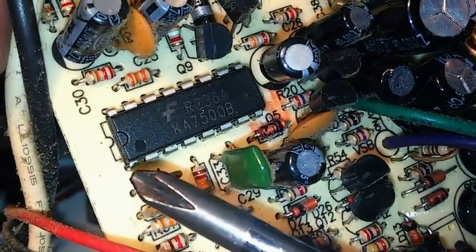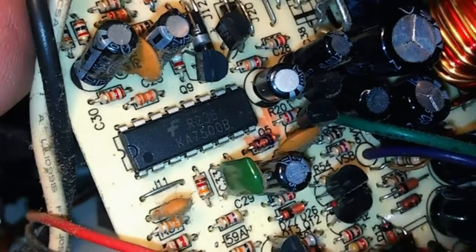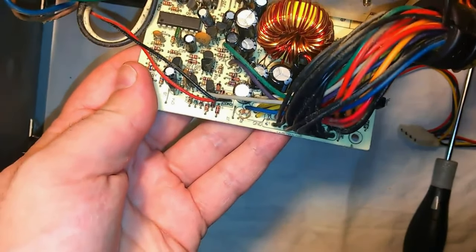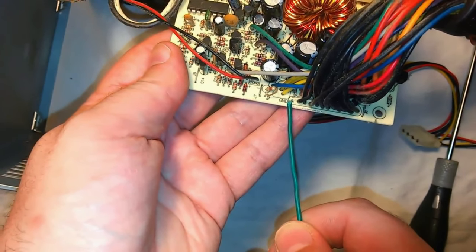Recharging must be carried out in places with sufficient ventilation because, especially in the final phase of the charge or during a too rapid charge, the electrolytic dissociation of the water occurs, which produces hydrogen and oxygen, which can create an explosive mixture if the concentration of hydrogen in the air exceeds 4%.